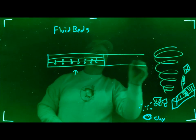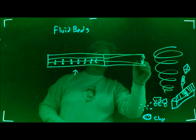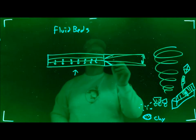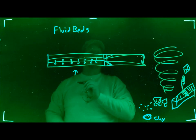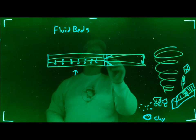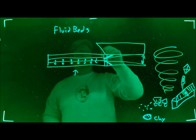So then you've got your funnel, which should be tapered, because you want to start out big and go small. You don't want to just go a short tube. Well, you can do a short tube and open up, but you want to get a funnel going. There's a thing in fluid dynamics when you make an orifice like that: you create a restriction, and you only get so much flow over the side of it. So you really have to get that taper going, and it has to be really nice and smooth for it to work. So anyways, on top of it, you shovel your material in, and there's our screen,